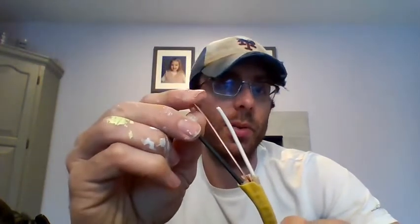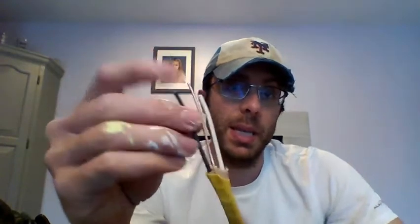The thickness of wire is measured in gauges — this is 12-gauge wire. If you take your box cutter or utility knife and cut open this yellow insulation, you've got three wires: your black is your hot, your bare wire is your ground, and your white wire is your neutral. Electricity flows up through the black wire, does whatever work it's got to do — outlet, switch, whatever — and then comes back down through the neutral wire to your breaker, completing the circuit. The ground wire just grounds the circuit to keep everyone safe.